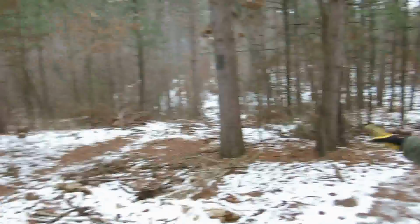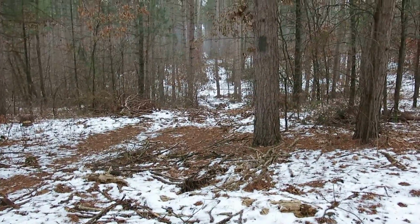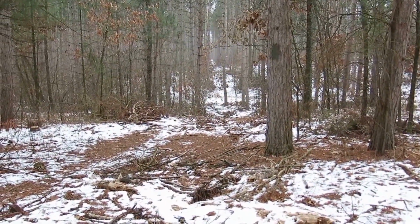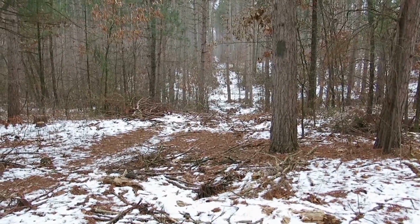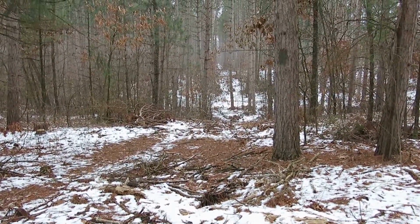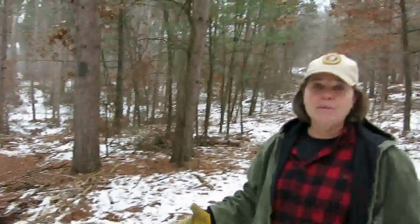This one is only about 120 yards, but the old trail went, as I said before, down the fall line, straight down the hill. So water's going right down that hill. That's what you mean by a fall line. So yeah, water and traffic go right down the hill, so nothing is there to slow down the velocity or reduce the volume of water.